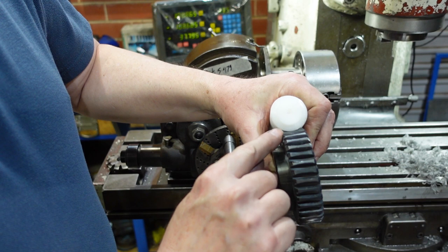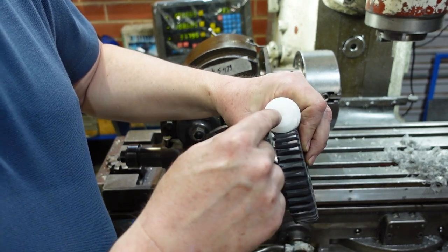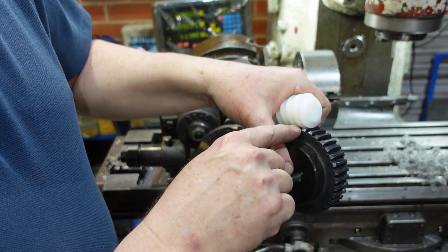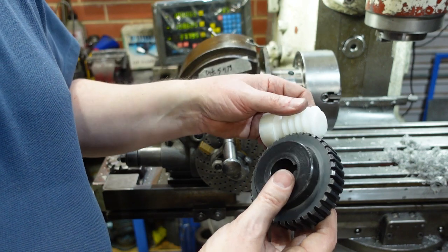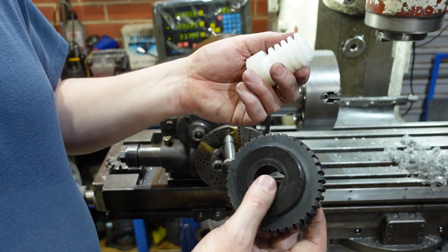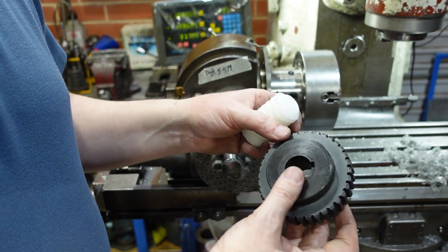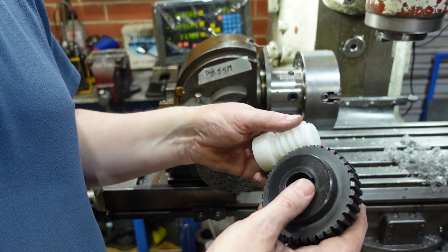That's the problem with this, but then again we're not making worms to transmit lots of power — we're making them for reduction purposes, so it's not a big drama. With commercial gears you'll find they've got quite a lot of relief — almost 60 degrees — from the base of the tooth outward, because that corner of the tooth really isn't doing terribly much. Anyway, that's the equations and the calculations for working out a worm and worm wheel — not terribly difficult once you know the trick to it. Thanks for watching, please spread the word, and we'll see you for the next one.